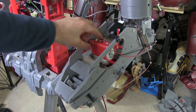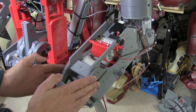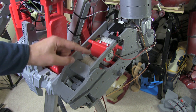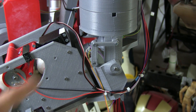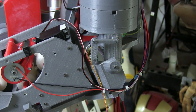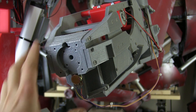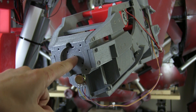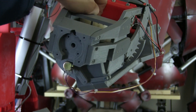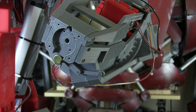It's now time to sort out the forearm. We've got this switching mechanism with a motor that moves on a servo, and it switches between three gears with worm gears attached - one that pulls the elbow up, one that makes it rotate, and one that will eventually pull the hand up. I've got one potentiometer fitted on the elbow joint on this crank - there's no way of putting it in-line without making the elbow really wide. I've now also fitted a potentiometer on the bottom with another crank so when this thing rotates it can measure that angle as well. If I rotate this thing we can see we get a different angle on the potentiometer.